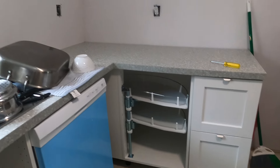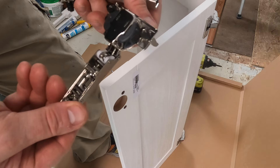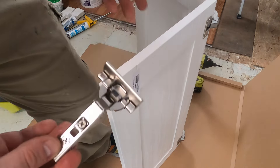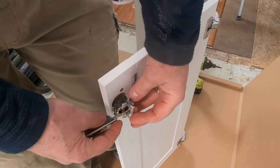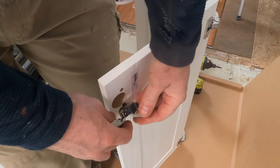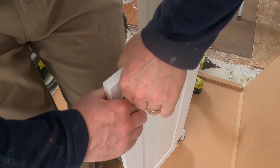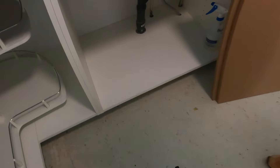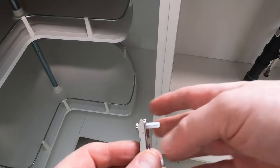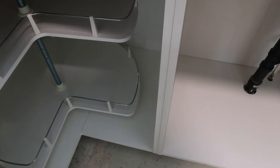Time to put some doors on. I wanted to show you these hinges — they've been around for a long time but they've really stepped up their game. You don't even need screws: you've got the big hole and the little ones, and this goes in and you just tighten it down — press fit tight, then snap. That's it, unbelievable. And over here they just go in like a wall hanger, tighten up the little screws, and then latch on. They've come a long way.